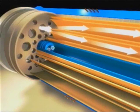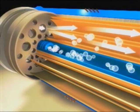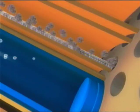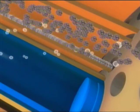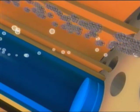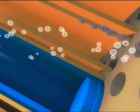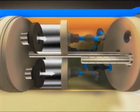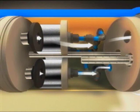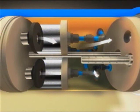through the feed channel. Simultaneously, air is pumped through the permeate tube, entering the permeate spacer envelope, creating a pneumatic cross-flow through the membrane surface into the backwash cross-flow, lifting and dislodging foulants on the membrane surface, which are then washed away in the filtered stream through the feed channel. This stream then reverse flows through the flow distributor and out through the pre-filters.